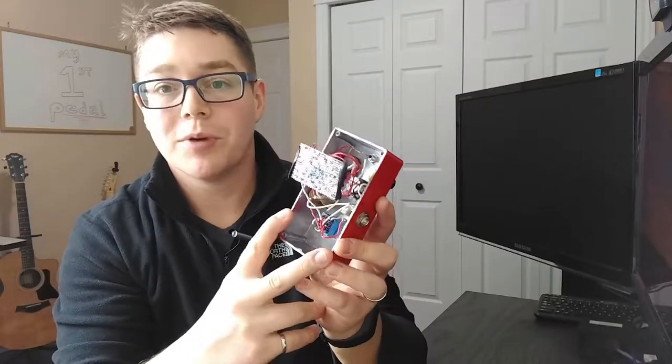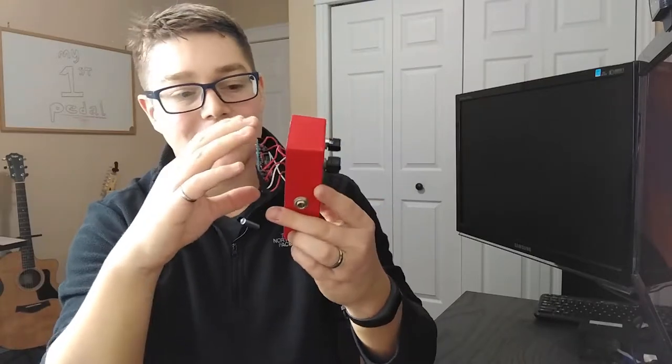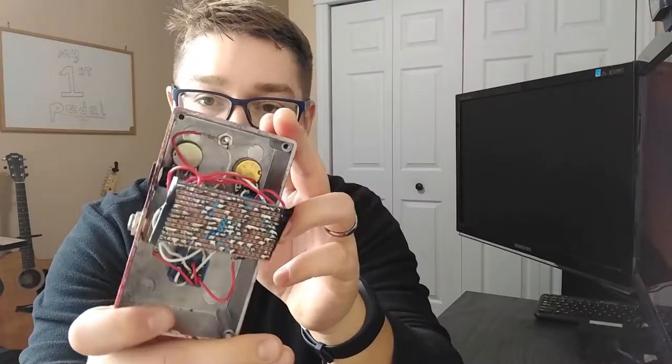As for the audio jacks, these are pretty good quality — I must have lucked out when I bought them years ago. I would probably still use something very similar in today's builds. One thing I noticed is my placement of the 9-volt adapter — I have it mounted at the top here beside my pots. All my builds now I actually mount it down at the bottom, because look at how much empty space is down there. Moving it down gives you more room for your board to rest and makes everything go in tighter. This 125B case really doesn't have a lot going on — it could probably go into something smaller. Looking at how I've wired my current limiting resistor — just bare wire attached to my LED — that's probably not something I would choose to do now.